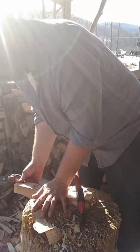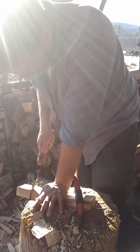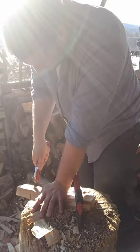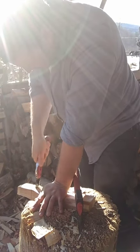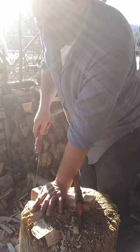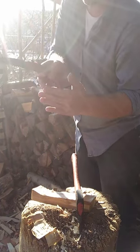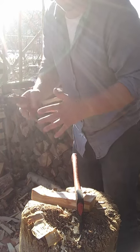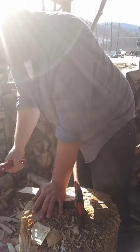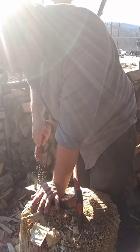I'm going to do the sawing again using the axe head to stop the pivot. When you're sawing with these pull saws, if you're pulling really hard it's going to jam up because you'll get a tiny little wiggle that creates a difference in the kerf and that creates a pinch point. You want to do nice even light strokes that aren't going to create a pinch point in that saw kerf.